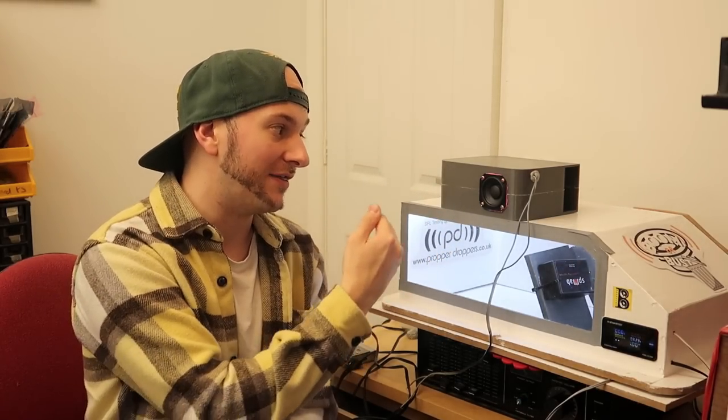But dB scores aside, I am super impressed with how this sounds. It's super clean on the scope and on the RTA. It will be lovely to listen to, and it's loud. And this benefits these kind of drivers that have low mechanical excursion on XMAX, but have a hard pushing force, have a strong pushing and lifting force against port loads. And that's what this box is doing. It's loading the cone at a few different frequencies there and making use of the strength that the motor has while not really introducing the distortions that come from mechanical excursion.